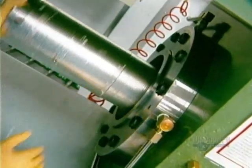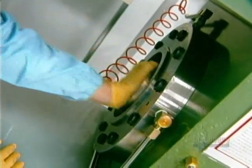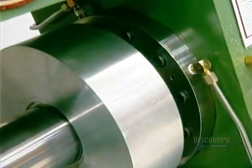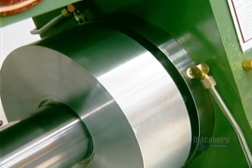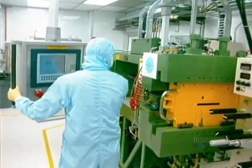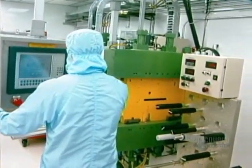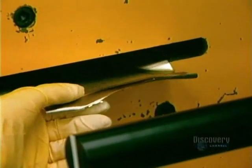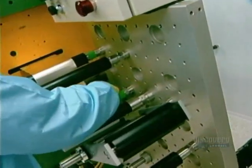It all starts with this lithium ingot which weighs about 5 kilos. It's transformed into a thin sheet by this extrusion press that applies 400 tons of pressure, producing a sheet that's only about 250 microns thick. The whole extrusion sequence is closely computer controlled. Extrusion is now completed — the metallic lithium sheet is the required 250 microns in thickness, or a quarter of a millimeter.